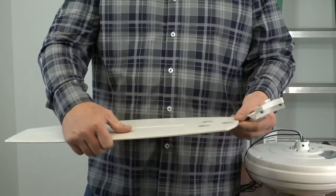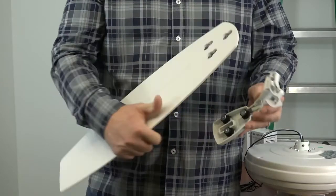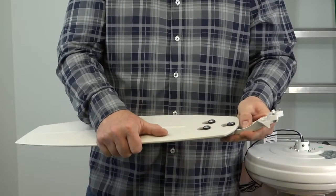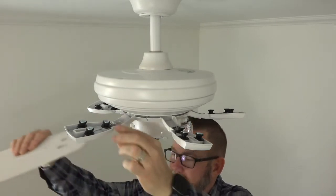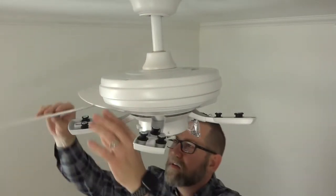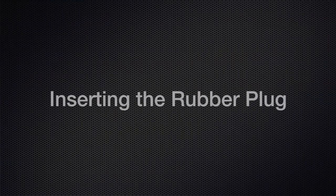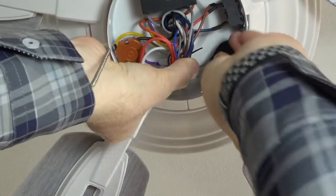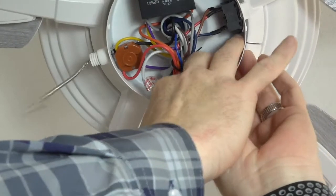This fan features quick-install blades. There are three keyhole slots on the blades that align with the three posts on the blade arms. The blades are reversible — choose the finish you'd like and make sure that finish is facing towards the floor. Align the keyhole slots of the blades with the posts on the blade arms, press down and pull away from the fan to lock the blade in place. There is a spring clip mechanism that will snap in place when properly installed. Repeat this process for the four remaining blades. Once all blade arms are installed, insert the rubber plug included in the hardware pack into the screwdriver access hole in the switch cup to seal it from water intrusion for outdoor use.